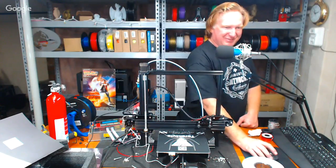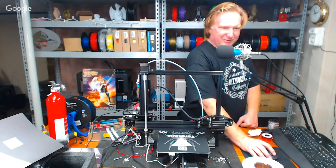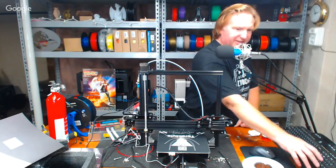Okay, I'm dropping the chat for just a moment here. Get back over here to my settings. So I got it set for 200, build plate for 60. It's set for the correct diameter. Looks like everything's good. We're going to do away with brim and go with skirt. Three lines.